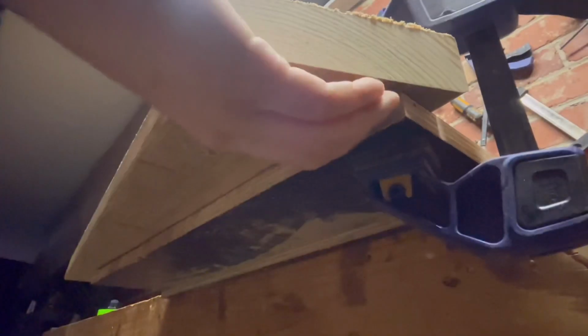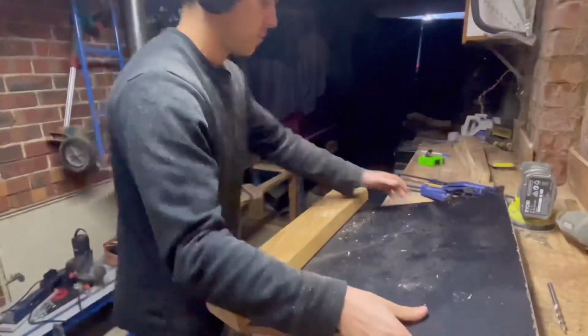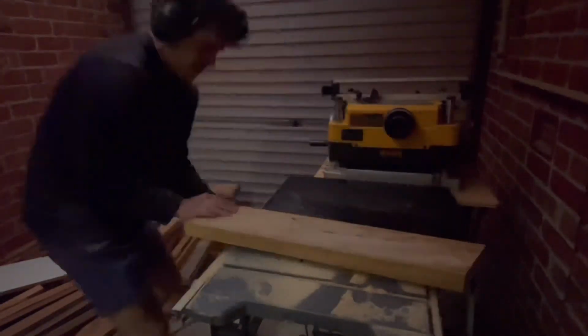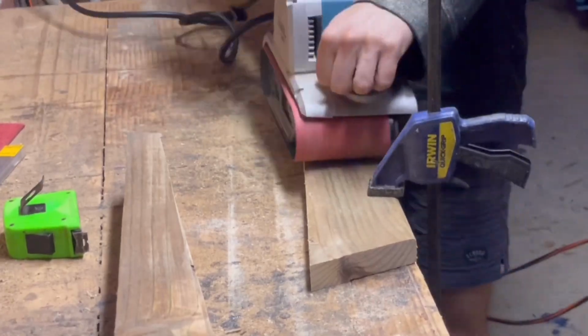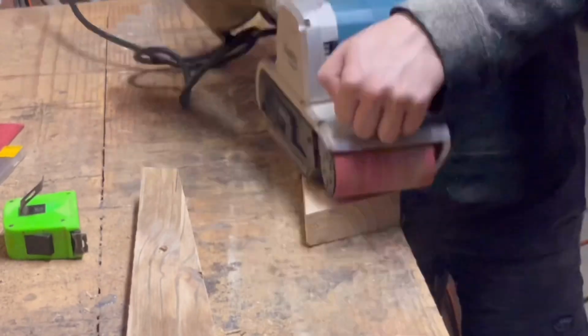After breaking yet another drill piece, I drilled in exactly where I wanted the screws to go in the jig so I could cut the front legs perfectly for the desk. So I made the jig, made the cuts, and then cut the thickness in half. So for the next part, we have 3 leg components that we're going to have to sand each of these pieces. Then once they're sanded, we can start to finally arrange them and glue them up. Although sanding is mostly boring, it is one of the most important parts of woodworking. It really makes the wood come to life.